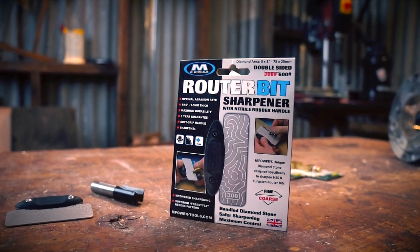If my bits are dull, they make my shop less efficient, which slows me down and costs me money. Now, 95% — and that's a random number I made off the top of my head — percent of the time your bits aren't actually dull, they're just filthy. They're covered in pine tar or they're a bit rusty. But if you've cleaned them and they're still cutting inefficiently, it's time to sharpen them.